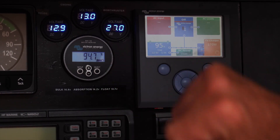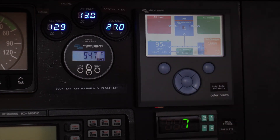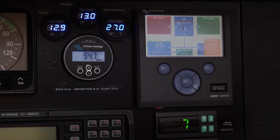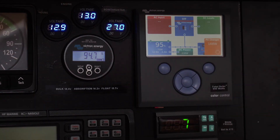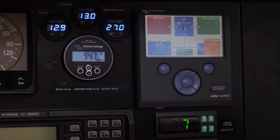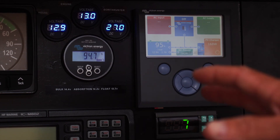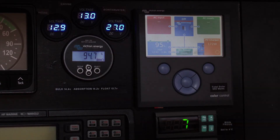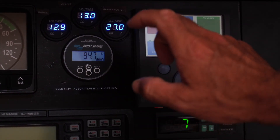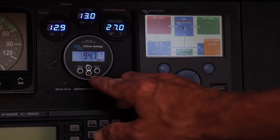And if you keep going down here, this shows you the equivalent amount in percent. So we're about 94.7% — basically 95% state of charge of the battery bank. This is a number I watch very closely, making sure that ideally we try to get up to full charge 100% every day. We don't always make it there if there are cloudy days or days we're using more electricity. But that state of charge percentage is very important, and you need to put in the total battery capacity of your bank before it can reliably report that number.